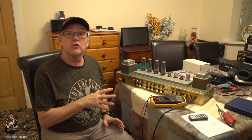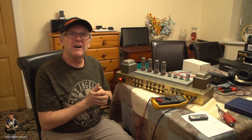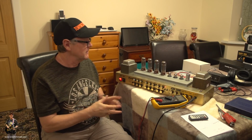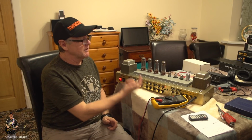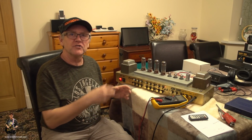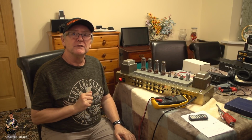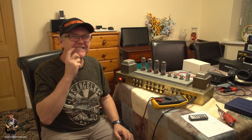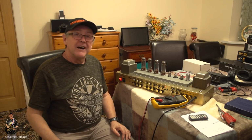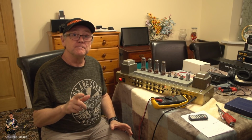Now then, as you saw on this meter, this particular meter, it's near as 75 as I want to get it, which is actually biasing it pretty high really, but that's okay. I could have done it 1,000 other ways. I could have gone internally and measured the internal volts and then done the maths and all the rest, but 75 both sides is going to work for you, and it'll probably work for me as well. However, there are other ways of doing tests, and I just want to cover one of them right now.